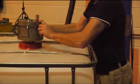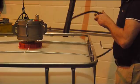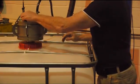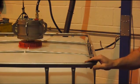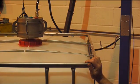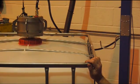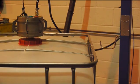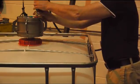The button can also be used by QC to carry out an offline periodic test, again without interfering with the main production line. The settings such as test time, test pressure and sensitivity are easily adjustable by a handheld controller. This feature also means that unauthorized persons will not be able to make adjustments unless they are in possession of this controller. The button is also attached to a standard screw cap, so it seals in exactly the same way. This ensures the cap to neck seal duplicates the original package integrity.